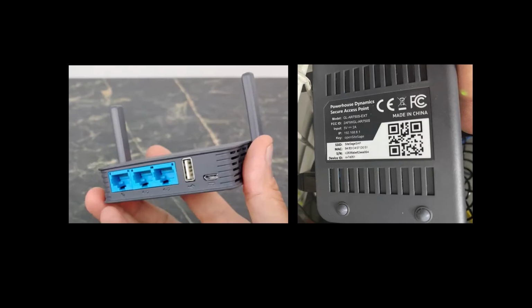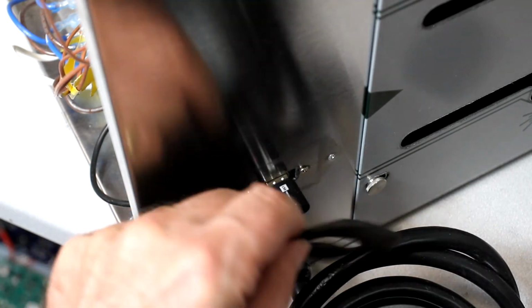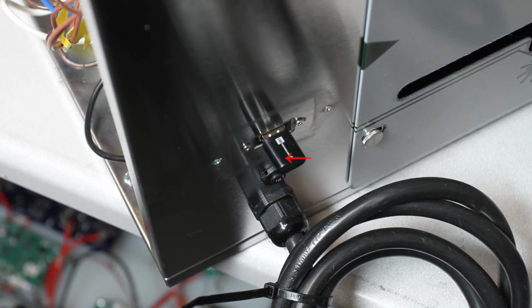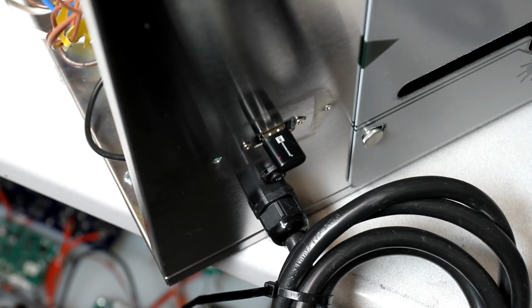If other Wi-Fi connected equipment are having connection issues, the store's router may be the issue. If the problem is isolated to one cabinet, the Wi-Fi dongle should be examined. It's located under a cover on the back of the unit. A tiny flashing red LED should be visible on the dongle.